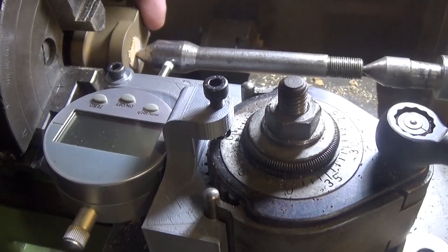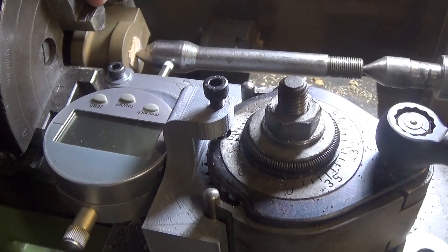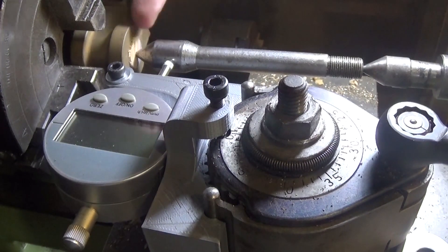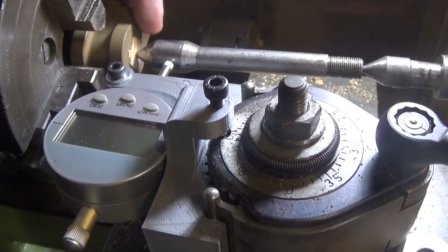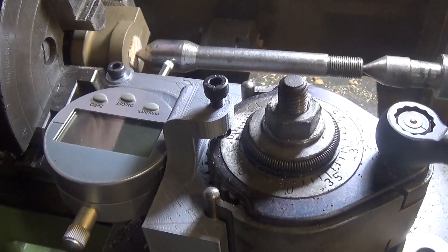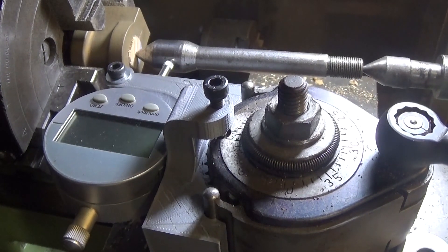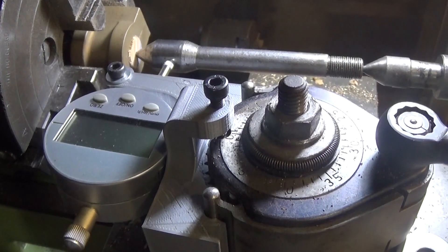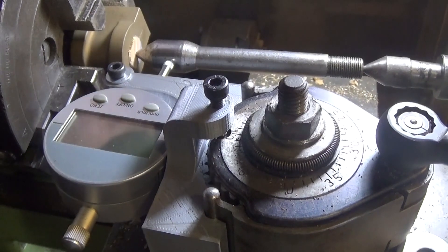Then we've got this side faced and the cylinder bored. There are a couple of ways we can machine the other side, but the best way is just to sit this up flat against the lathe or on the face plate, or even on the milling machine table and mill it off nice and square. That's not a big deal — but that's where you need to be with that, and it won't take a minute. When you've got this set out, just drill the plug out, bore it out and run a reamer through it — whatever you're going to do. And as Tom Lipton says, Bob's your uncle.